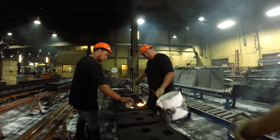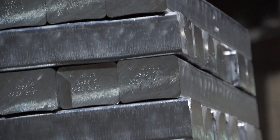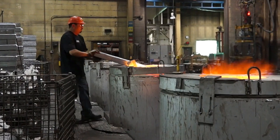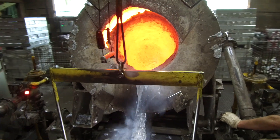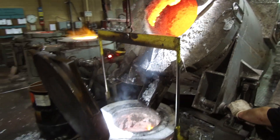There are other cases where you'd want metal integrity to be such that you have no voids, no pits — explosion-proof devices, any time you have a flame path that you have to deal with after machining. You can't have so much as a 10-thousandths pit somewhere on the surface; those will be detrimental and actually cause a failure.